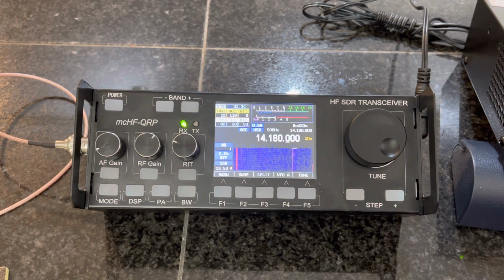It's going to sort of look like the power supply to some degree. It'll have a meter. And what you're trying to do is make the impedance match. And impedance is AC resistance to the flow of current. And so what we need to do is make the antenna appear to the radio to be roughly the same impedance as it's looking for, which is nominally 50 ohms.